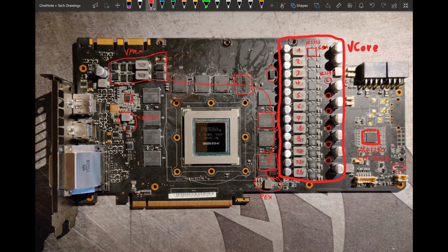I was also told that this can be memory controller damage. In that case, the card will stay dead, because if the memory controller is in the core, and the core is dead, there's not much I can do. But I'm hoping that if I get 3 replacement memory chips and put the missing one on and replace the 2 dead ones, I could get a working 980 Ti out of this.